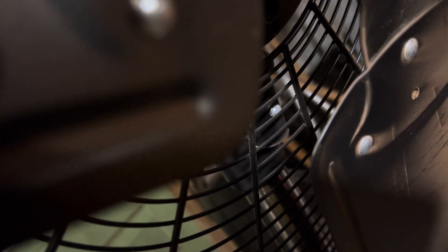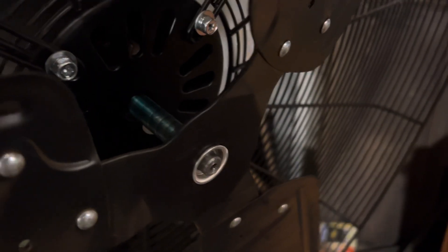We're going to start off here by removing the blade off the shaft. The front guard is already over there waiting for some cleaning. We got here a standard set screw and this one does fit. One thing I like about these longer set screws is that they are much easier to actually use when it comes to cleaning and servicing these fans. A lot of people tell me it's not good to use a long hex or a long set screw, but I find using longer Allen keys is probably much easier to do.